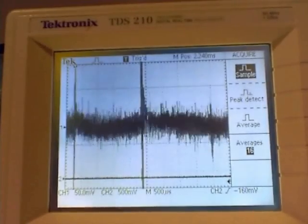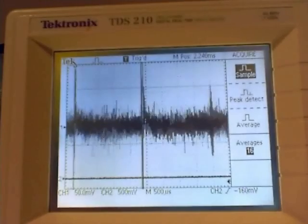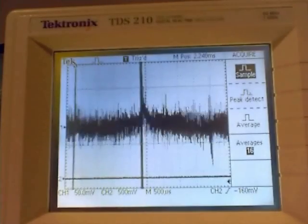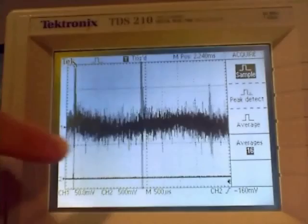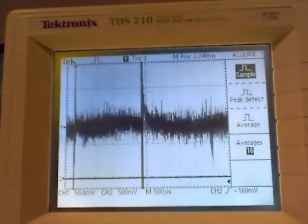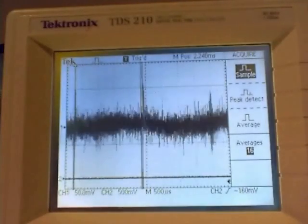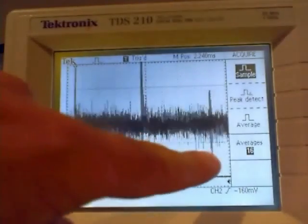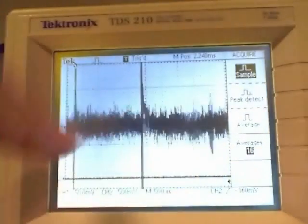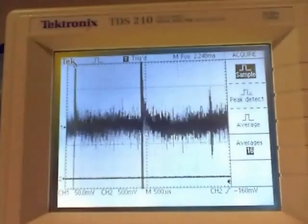What I've got shown here is two pulses being produced by my NMR spectrometer. The first is a 90-degree pulse, which is right here, and that's about 25 microseconds in length. The second pulse is right here, and that is about 50 microseconds in length. The spin echo is occurring at double the time — right here — and then the same length of time after, and that's our spin echo right there.